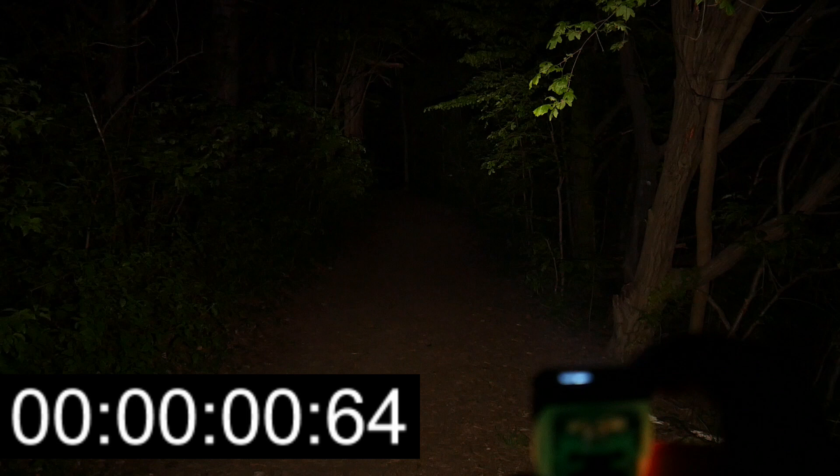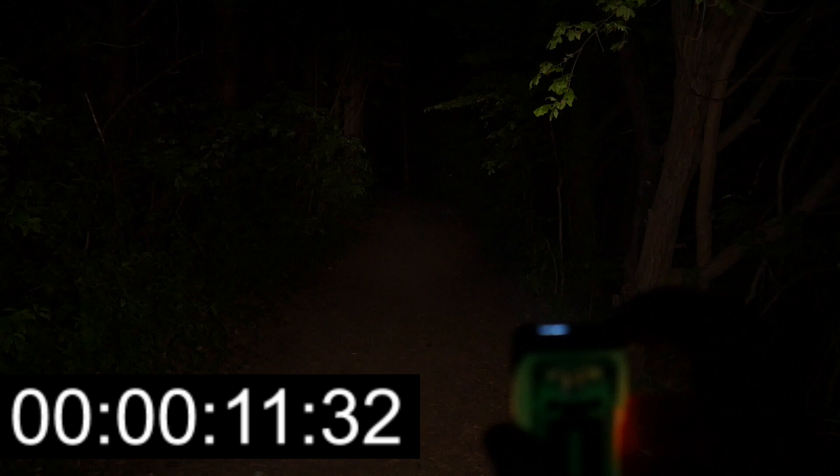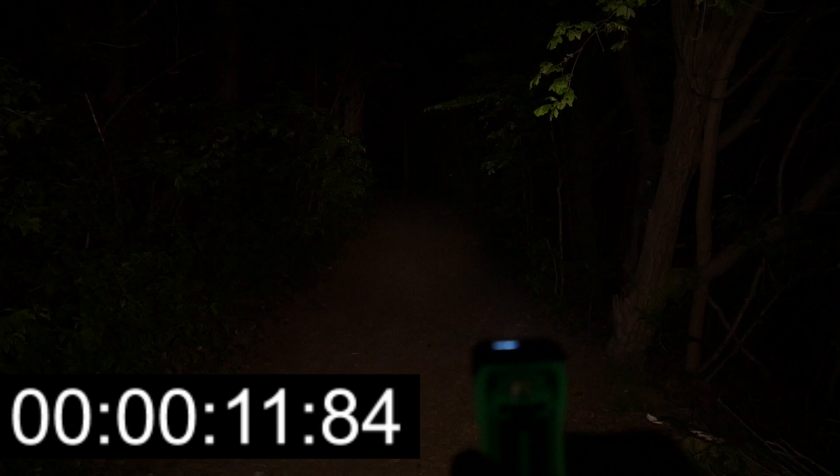Now I go to turbo and keep the light steady so you can see how the brightness fades away. The camera is on fixed exposure. This is full brightness — and after some time, when the heat builds up, there it goes, the brightness fades away. And now it's back to about 180 lumens. It's possible to double-click to go down to 150, double-click again to have full brightness, and again you can see the light fading away.